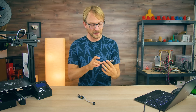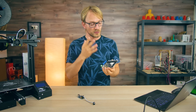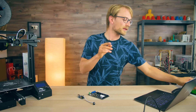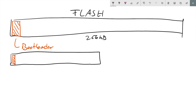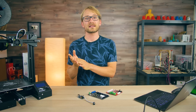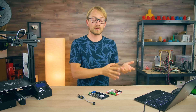The largest 8-bit processor you could have is the ATmega 2560, which is on this board and many others, and that comes with — as the name suggests — 256KB of flash memory. Yes, that is kilobytes, not even megabytes, and 8KB of that are already taken up by the bootloader according to the Arduino page. The ATmega 1280, which is used by a lot of budget 3D printers, is basically identical to the 2560 but has less flash memory — 128KB, as the name implies. Arduino says only 4KB of that are used by the bootloader. Still, it's 4KB that might make the difference between fitting a firmware with all the features you plan on using versus not being able to fit it on the processor at all.